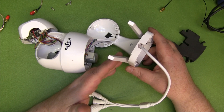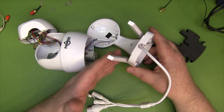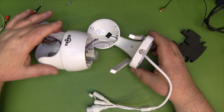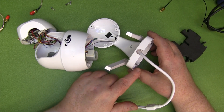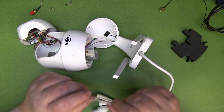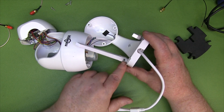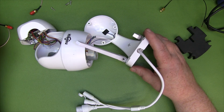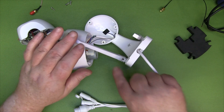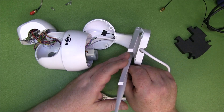I'm thinking about positioning on my house — one side has line of sight with the receiving box, while the other is slightly blocked by a corner wall, so I want the clear side to be active. To get the pigtail through without dismantling more of the camera, I'm going to cut the old antenna off at the bottom, use a bit of tape to connect the pigtail to the end, and pull it through. I'll also check the dB rating of the original antenna I'm replacing — the new 5 dB omnidirectional antennas are noticeably bigger.